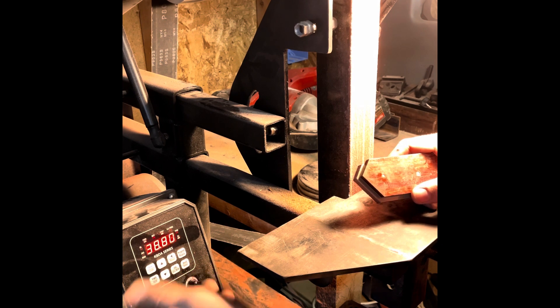Once you're done profiling and the scales are the same size, change the angle you sand at to get rid of scratch lines in the wood — I switched directions to prepare for the next grit. Don't skip any grits: I'm starting with 80, then 120, 220, 320, and we'll see from there. Keep consistent pressure on the belt grinder — don't push too much to either side. Keep it real flat until you're ready to contour and shape the handle.